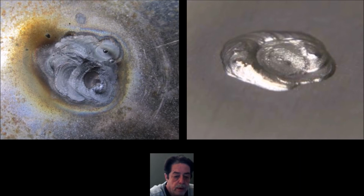But when you're doing holes, we're talking about filling holes. I don't worry about wire speed. I usually have it turned down. I mean, you'll get a feel for it. What's more important is that temperature setting and setting it to the thickness that you're using. Now, the charts on the inside of the better welders are fairly accurate. I'm not going to tell you they're totally accurate. They're not. And yes, I still tweak mine. But I would start off with what their suggestion is.